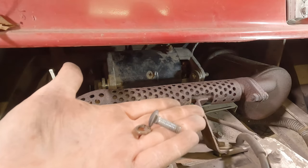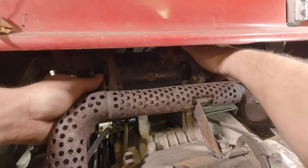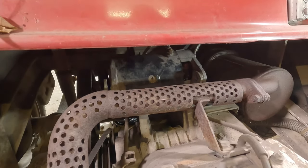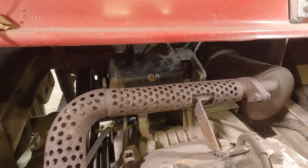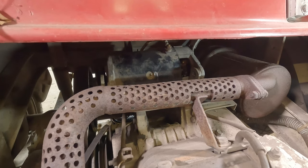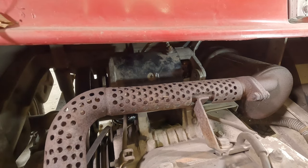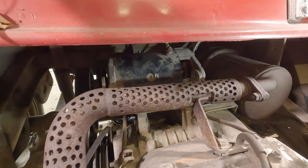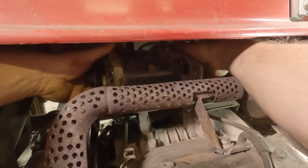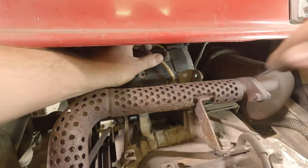The starter generator belt comes right off. While I'm here I'm going to remove the positive battery terminal — which I should have done before. Now you can see the access we have here is basically none. Battery positive terminal is disconnected. I should disconnect all these wires before I try to move this thing out of here. You don't have to take off the jumper wire — you just need to take off the DF, the ground, and the power, so you need 10 and 8 millimeter sockets.